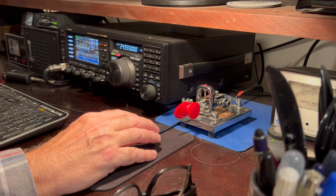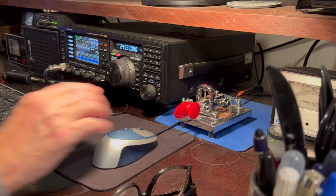The first contact was on 17 meters and the second was on 12 meters, and the antenna worked fine. I did see the SWR was still a little high on 17 meters, which is confusing. I may have to go tinker with it a little more to get it to tune better — or I could just run it through the tuner, though a dipole is a resonant antenna and you really shouldn't have to do that. These are two bands I don't usually operate because I really didn't have an antenna for them, and now I do. One thing I learned is how the two dipoles interact with each other. They're slightly on an angle from each other, and there's that proximity effect. When I readjusted the 12-meter legs, it likely had some effect on the 17-meter legs. Getting it further up off the ground made a difference too.